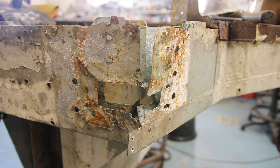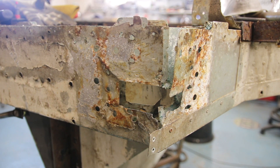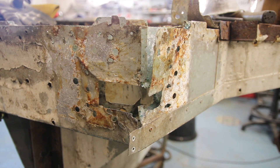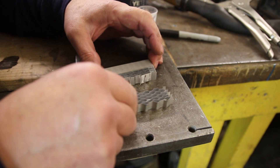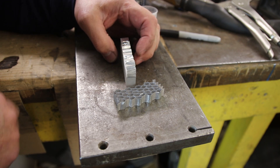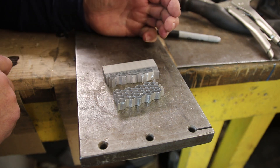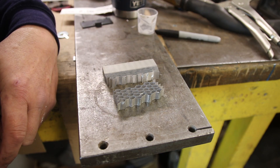There's a bigger problem though. We've got bits where no amount of resin is going to put things back together, so we've got to use something different. This wonderful substance is unexpanded aluminium core — it looks like a solid block but it's actually honeycomb, and it stretches out like a big accordion. We couldn't get the thickness we needed, so this has been cheese-wired down and a slice taken off the side so that it fits. There's too much to tell in this film, so we're going to have a go at making this work and let you know how it goes on the next one.